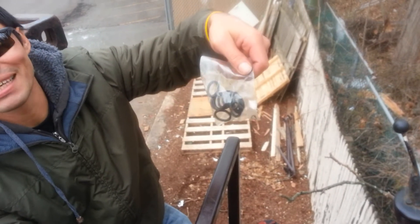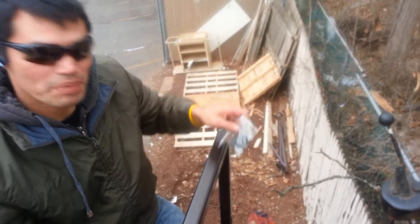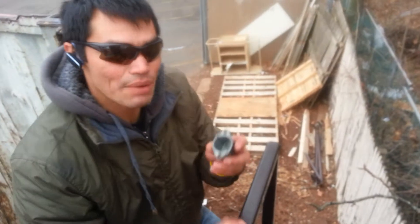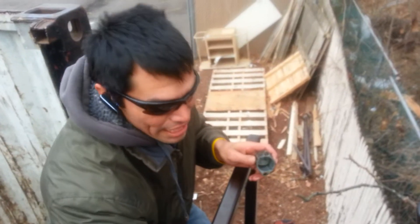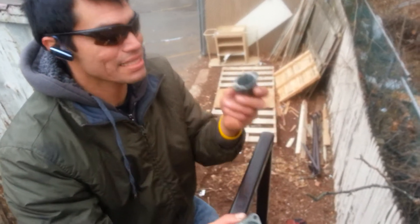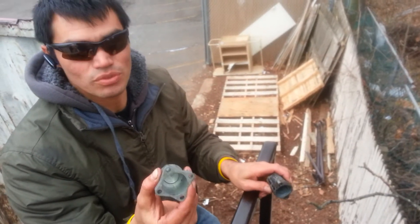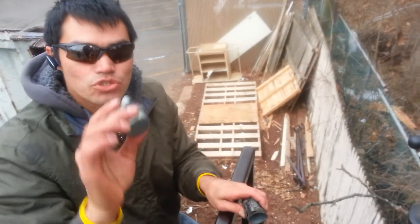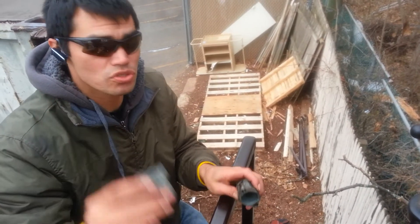So you have an idea — it's 12 seals, which comes down to $4 a piece, which is not that bad. The problem was that while driving on the highway, one of these little suckers fell off, so I'm missing one. At the hydraulic shop they had something similar — not exactly the original, but close. It's about 1/1000 of an inch different, which means nothing. This one has a breather hole, and I had to make a small modification to add a breather hole on it just like the other one.